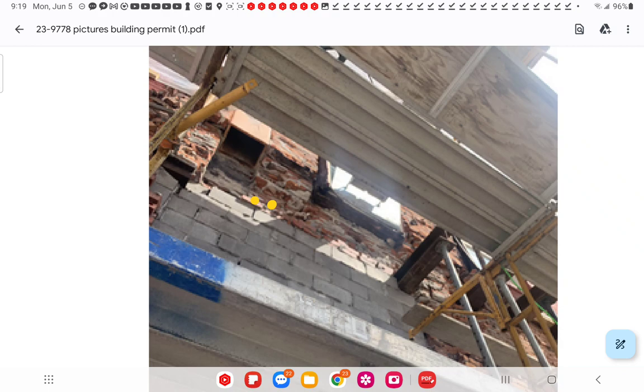I don't know. We have this soft mortar going on. We have expansion and contraction over 100 plus years. I don't know what this is. It presents as hollowish also. It might be a piece of steel scaffolding coming from that direction. We have control joints that are expansion joints that are not really done correctly all the way through the building and through the new brickwork they put in. We have the new brick butting up against old brick without all expansion joints.